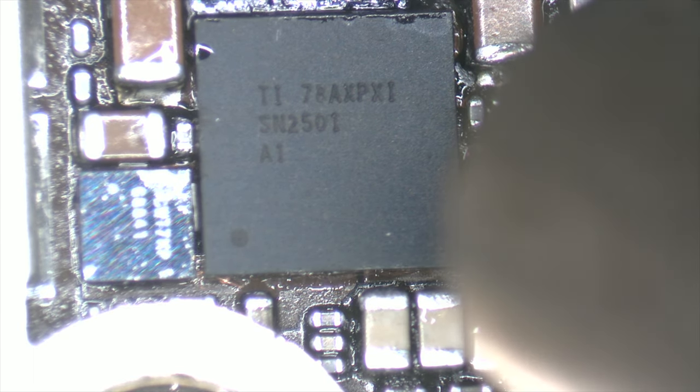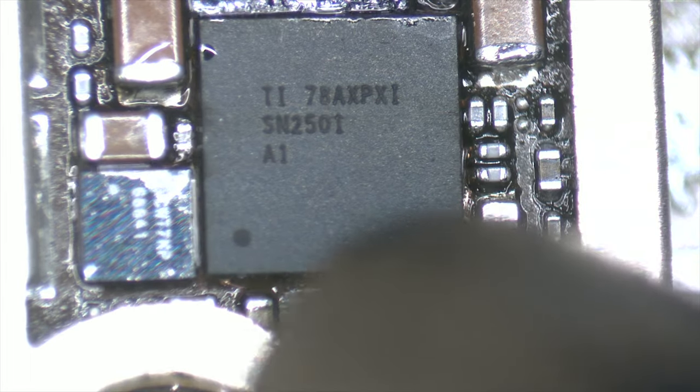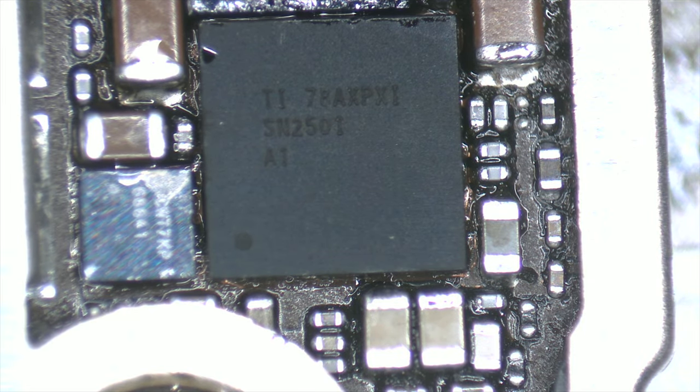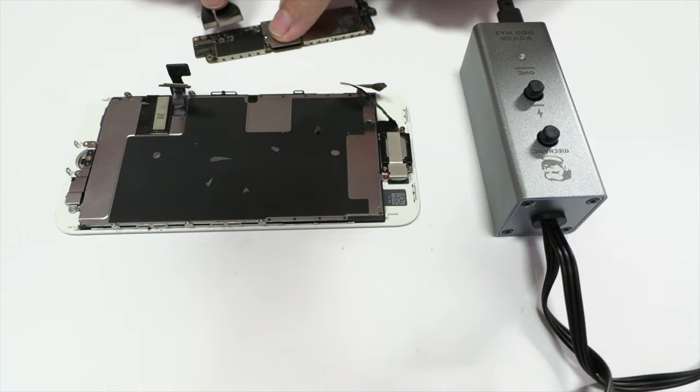To solder the integrated circuit, we apply a little flux and solder it at 380 Celsius degrees and 40% airflow. We can observe that the circuit finds its ideal position by itself. You just need to find the ideal air temperature and airflow for your station. Each air station is different and you have to find the balance point to offer the best possible work.